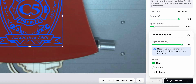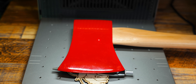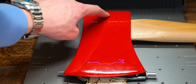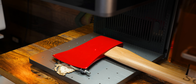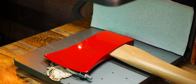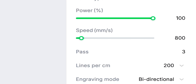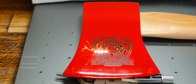No matter how good any camera is on any brand of laser, you always want to run a frame first. I'm going to use the outline frame option — this is a little too far to one side, so I'll adjust. I like the outline frame because if the design has sharp edges it shows the exact boundary. When you run into different materials like this you need to line it up right in the middle to make sure placement is good because your eyes can fool you. I have the AP2 air purifier on. I'm going to take a napkin and put it against the exhaust — this is not going to pull as hard but it is going to help save my filters. The powder coating is on there, so I'm going to run this slower, about 800 speed, and I think I'll run three passes to get all that paint cleared out.